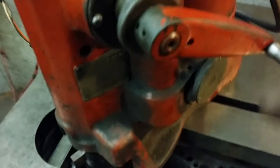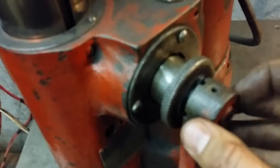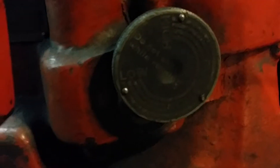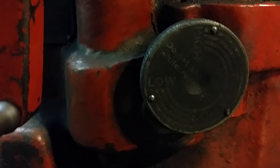Come up here to your power switch, flip it on, and start your cutting. You've got this collar here — this works the hand crank but it also engages the gearbox. This gearbox is two speeds: low and high. Never want to change gears from low to high or either way while the machine is running — it will crash. I always run my machine on low speed; you get a much better finish.